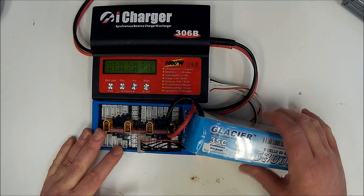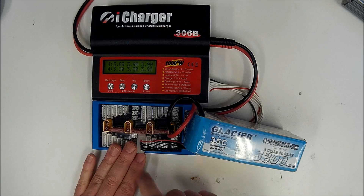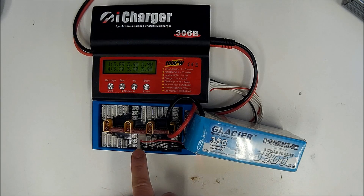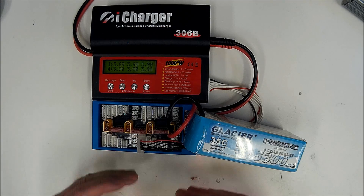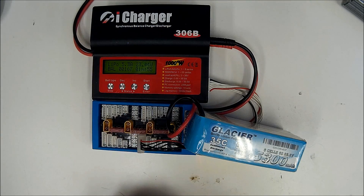Because this was at a storage state, at a 1C rate it'll probably be charged up in about half an hour. And that's as easy as it is — very simple. I've been getting questions on how to hook up the battery to the charger. You do need to plug both the main power lead in and the balance lead. All the current is coming into the battery through the main plug. The balance lead just applies various loads to the different cells if they get too high in voltage separation from the others. Hopefully that helped everyone out. Thanks for watching.